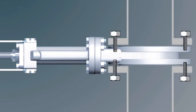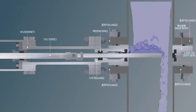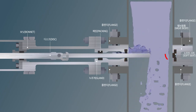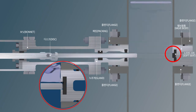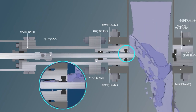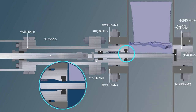Our development product does not accumulate fluid residues on the valve body owing to the soft seat inserted into the seat side. As shown on the screen, with the valve closed, the bottom will get pressured after the disc pushes the soft seat side. The top will have double sealing. The disc gets pressured to the soft seat as well as the metal seat simultaneously by the fluid pressure.